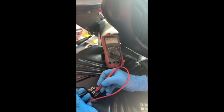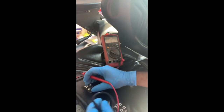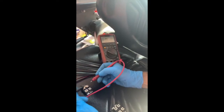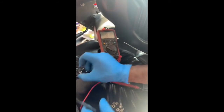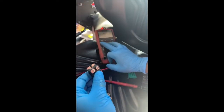Test this one and that goes into closed circuit, and that goes into closed - so that's short circuited. Let's test the new one: there should be nothing on the other side, yep, and there should be nothing on the other side, yep. So that's a good one. This one has one side blown. Let's put a new one on and see what happens.